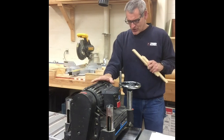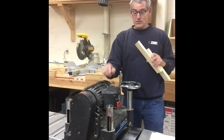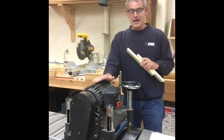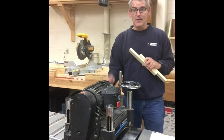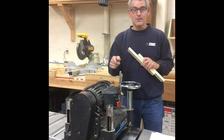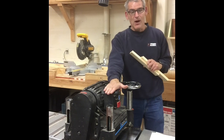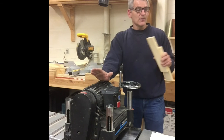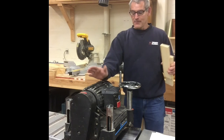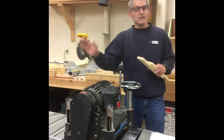When you finish, just like on all the machines, you need to stand here until the cutter head winds down and stops moving. Turn it off and wait for everything to stop — on the table saw you wait for the blade, on the miter saw the blade needs to stop. Make sure all the guards are in place, and then you can leave the area. You don't want somebody to come over and start putting something in while it's still running.